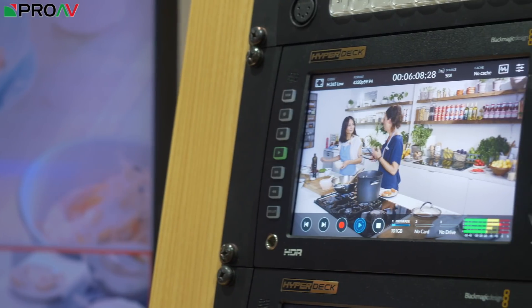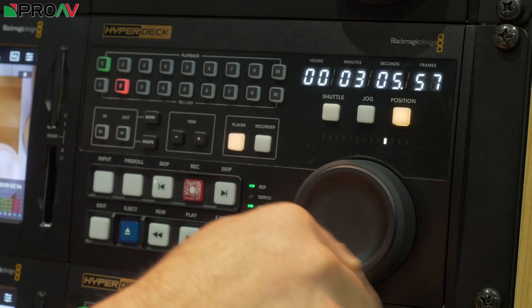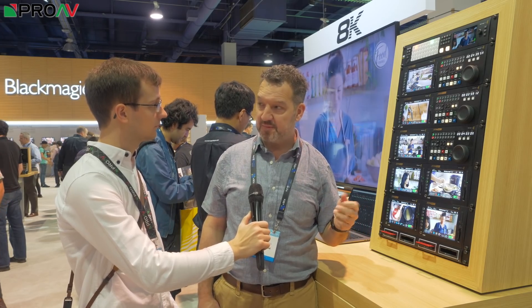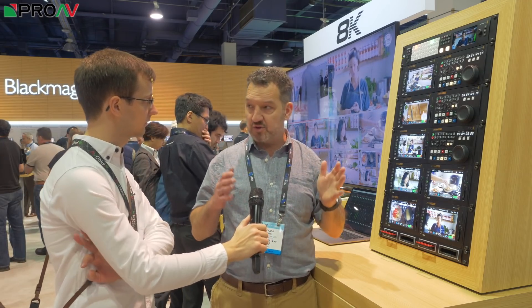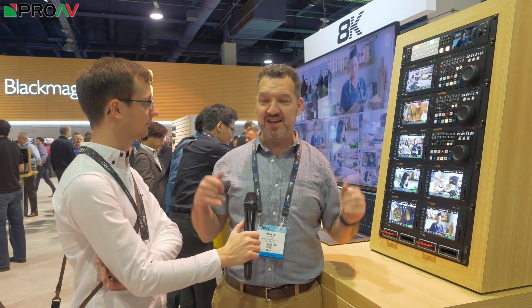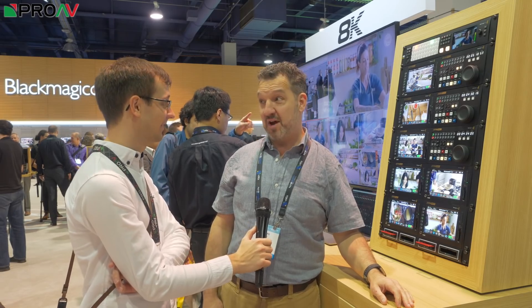What this can do is allow you to dub legacy formats across to H.265, which it records onto CFast cards or USB-C drives with SSDs. Or it will act as an 8K recorder and playback unit. If you don't want 8K, it can record four channels of UHD and play them back — for example, for projection mapping with four 4K projectors, using this machine to supply all four with a 12G SDI feed. It records them to one 8K file and each output is a quarter of the picture. It's just like when we originally went from HD to UHD using a quad-link system: four times HD equals UHD, and now four UHD equals 8K.